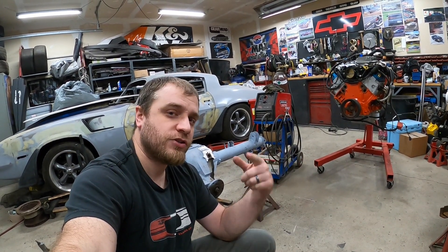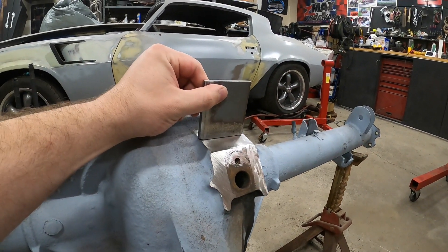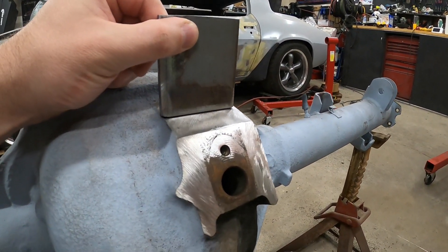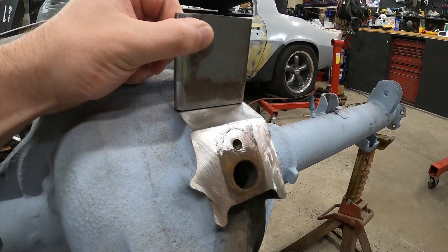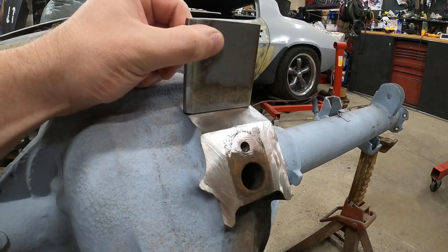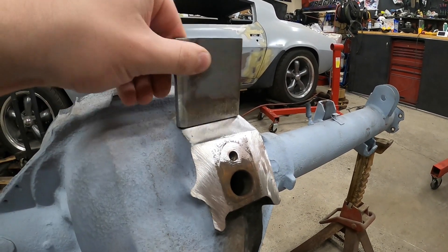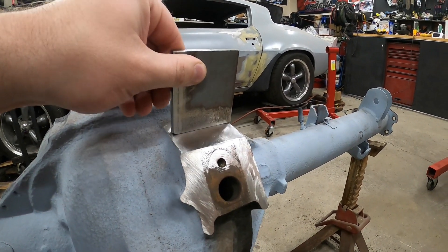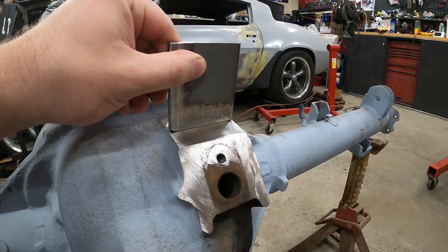What I have found is that it's actually neither. I'm going to weld this piece of mild steel on here. I'm going to do it with my MIG. I'm going to use stainless wire because it does have a little more nickel content, and do that with no preheat, no post heat. Then after this is all set up and welded, I'm going to bash the piss out of it with my sledge and see if it breaks at the weld point itself or if the steel breaks past the weld.